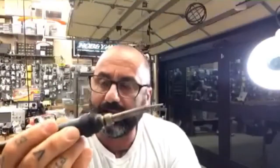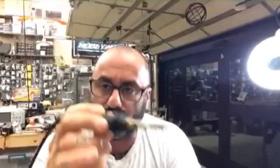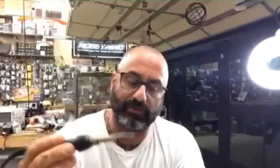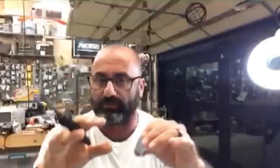And here's the deal. I try to keep my soldering iron in tip-top shape whenever possible. Here's one of the things that I've started doing, and I would recommend that you do it as well. Over here to my right, which you can't see, I have one of those Brillo sponge cleaners, right? So you put your soldering iron in there and it scrapes off the remaining solder on here, and it kind of fits it into all the little mesh Brillo pad looking copper sponge here.